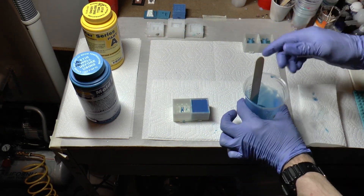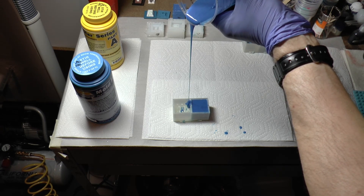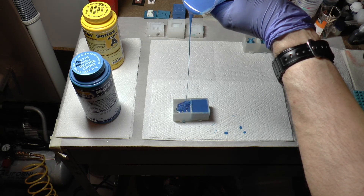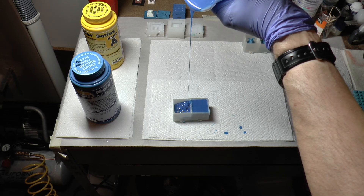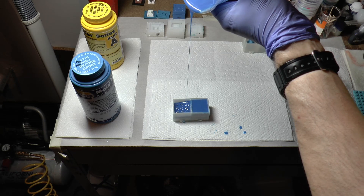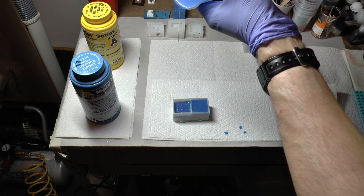You do that for however many molds you're making, and then you start pouring from one side, letting it fall into the bottom on its own so it flows around everything. One thing I recommend is to fill it up only to just before the top of the screw holes. That way, once everything is cured you'll be able to slide it right off — it's not going to stick inside. The other nice thing is that it makes a little volcano effect, which means all the resin will come up in little pancakes on the top and they flick right off, making cleanup really easy.